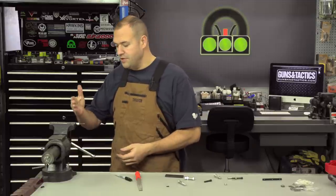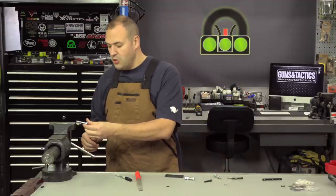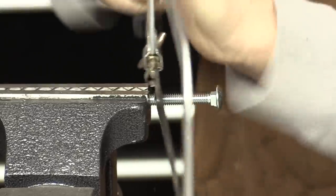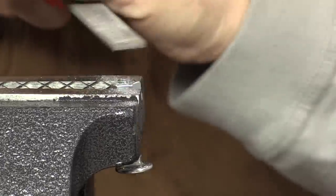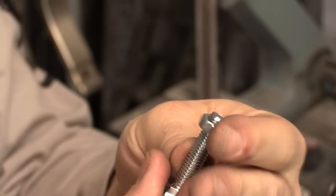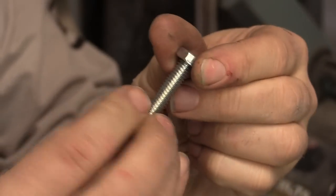As far as what you use to cut, you can use a saw, a cutting wheel, a side cutter, or a bolt cutter — it really doesn't matter for that rough cut. For larger screws and bolts, you'll probably use a saw using one of the grooves as your cutting guide, which will make an angled cut. When you end up with that angled cut, you can put the nut in the vise to act as a guide and file off the proud surface to make a nice smooth surface. Then take the screw over to the belt sander and put a slight taper on it. After that taper, you can use the nut to go back and forth and clean up those threads. If you have a die you could use that too, but truth be told a good quality nut does the same thing — it chases the threads a little bit. Now you have a usable screw that looks and works just fine. Let's go ahead and actually do this.